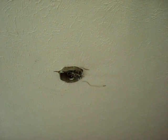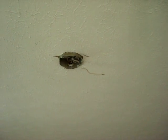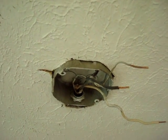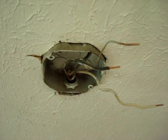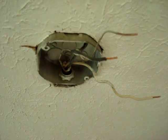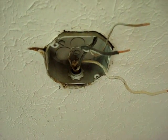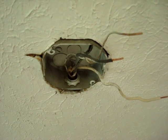In this case, the homeowner who is doing other work here now has inherited the problem of this fan. So what I'm going to have to do is crawl into the attic — it's a 4/12 pitch roof, so it's going to be about 10 inches high. I need to shimmy down into the attic, pull this light box out because they do want to keep the fan, install the correct fan box, hook everything back up, and it'll look just like it did before except it won't be hanging down.